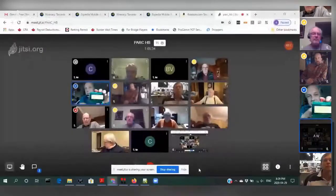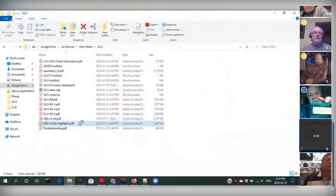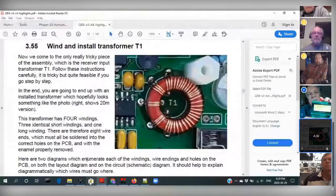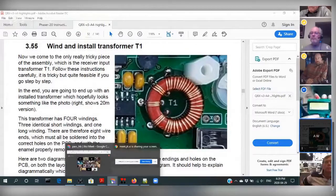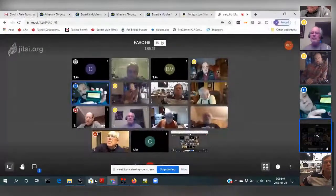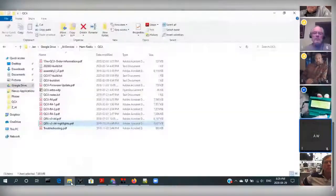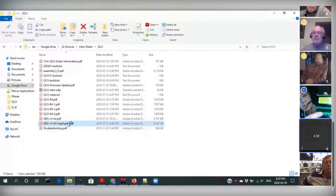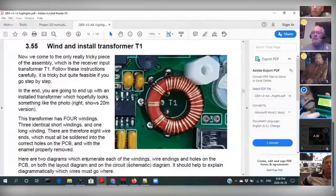Peter, you started this, right? Because you wanted to put an attenuator on this in association with the SIGGEN. I had bought a couple of boards as well, but never got around to doing the software because I just wanted to add it into Dave's routines. So I hacked into your routines, Dave, and now there's another menu on here for attenuator settings, which you can go through and dial up how many dB you want attenuated. The control lines come out on the bottom here. It operates the 4302 attenuator chip in the parallel mode, and these control your dB attenuation.